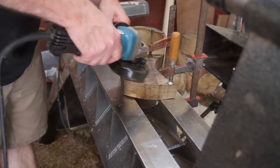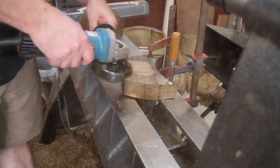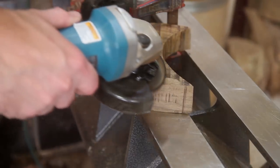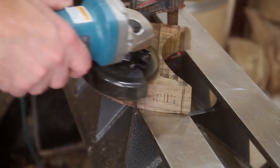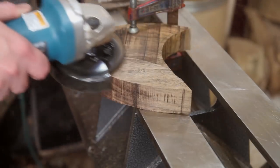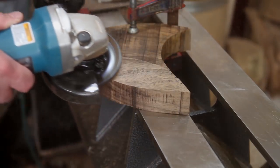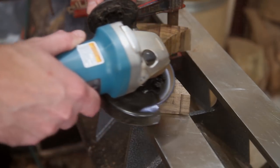As far as the bill, again, I grabbed the ArborTech. It works fantastic. I had a couple of questions about that, about going with the grain or against the grain, whether it grabbed. I haven't noticed it grabbing either way, with the grain or against the grain, but it is a little bit rougher coming against the grain. But what it does is eliminates the dust. It's actually cutting the wood instead of creating a giant dust storm. So that's a huge plus there.